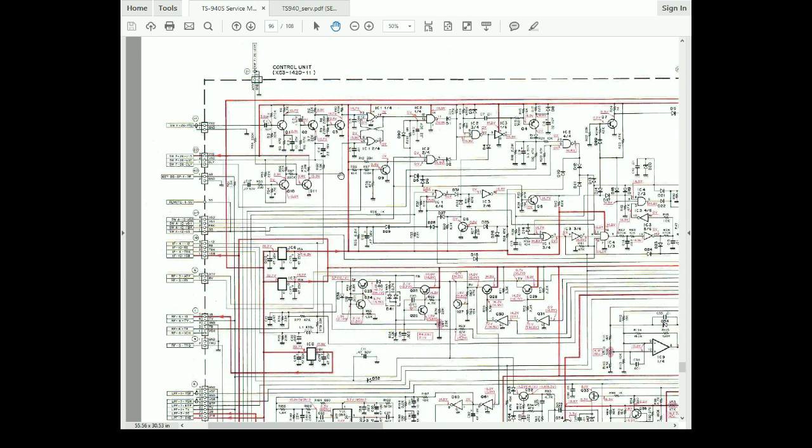They're also gating that with what looks like anti-VOX. I think that's anti-VOX. Anyway, it doesn't really matter. We'll find that out later. But suffice it to say that with the VOX switch off, we're getting triggering in here. So obviously this is detecting VOX audio. So we're getting triggering of this gate when we shouldn't be.